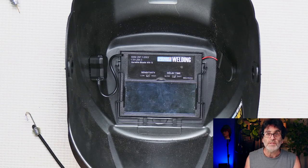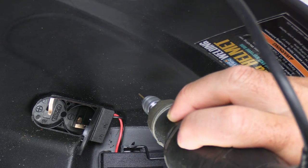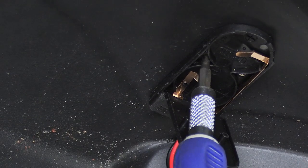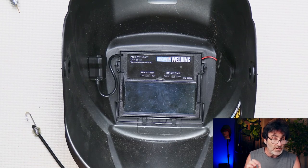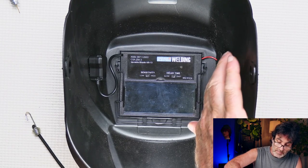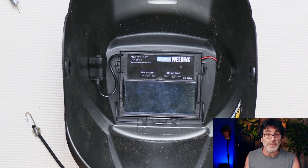I've got my battery holder mounted on the side right here. If you pop the hood, there are two holes you can drill. The tiny screws that come with it are a joke — the heads will pull through if you even sneeze on them. I ended up throwing those screws and using slightly bigger ones. It's mounted nice and solid, with a fairly short wire — we don't need a long one. I already tested it and it works great. There's a solution to replace the batteries on one of these welding helmets. I hope this video has been helpful. Thanks for watching.